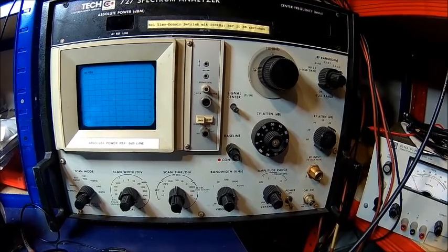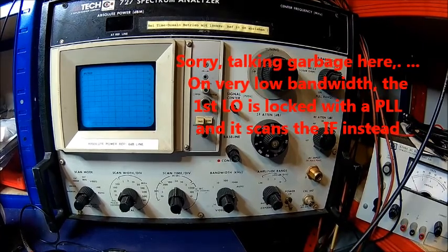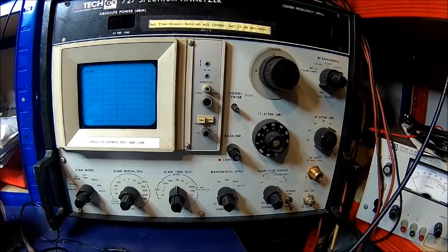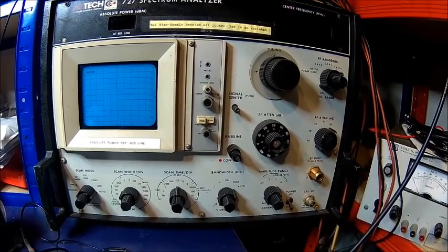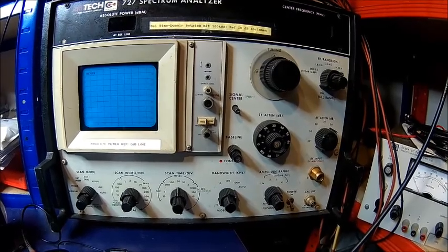It's got some sort of PLL unit, so you can probably do 50 hertz or 100 hertz resolution at 20 gigahertz. You need to warm it up for about half an hour, and then it just sits rock solid — it's unbelievable. It's a fantastic machine.